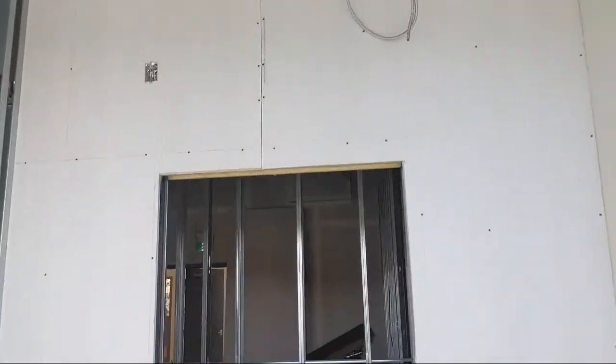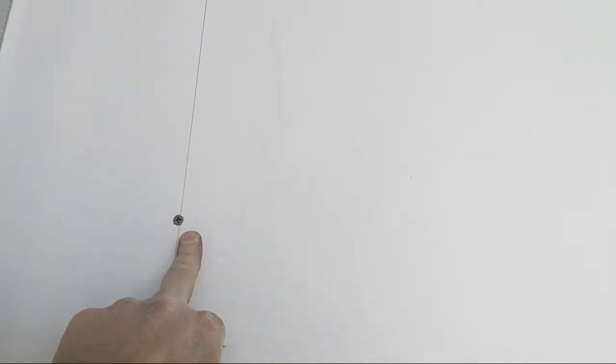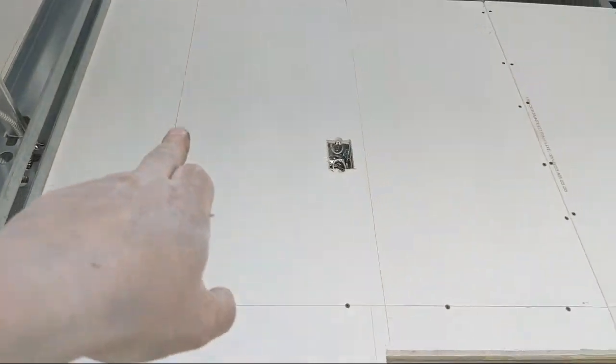It's gorgeous. I map out all of my steel because I have to know where, because these 1-inch screws go into the pocket door studs, and 1.25 go into the other ones. So if you can see, these are the pocket doors. If you use a 1.25 screw, it's going to stick out 1/4 inch. Okay, the 1 inch is the right size to use for pocket doors. You can kind of see right there how it just hit the inside. That's the 1-inch screw.